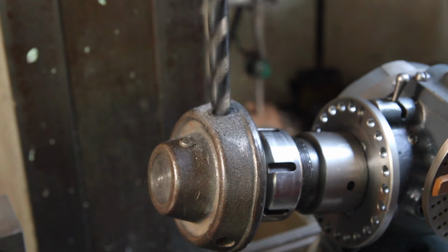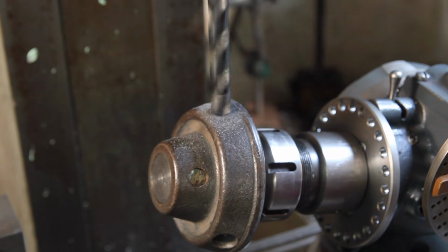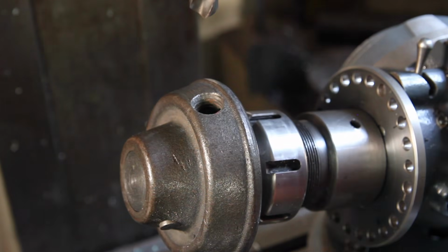I think most normal people would use a helicoil here, but it's a 7/16 fine thread, which I don't think would be something that I would use the rest of the kit on, and the kit's pretty expensive, so I'm going to do something a little different. This one's also been blasted out to the point where it needs a little bit more help than a helicoil.